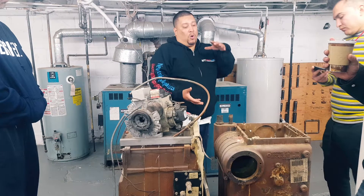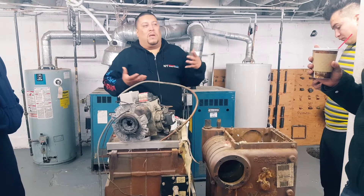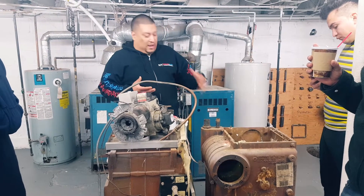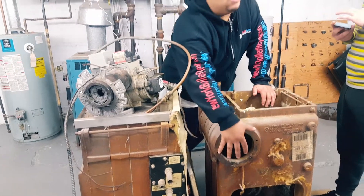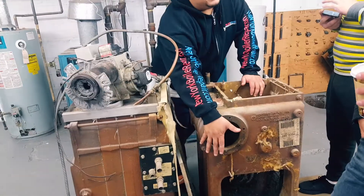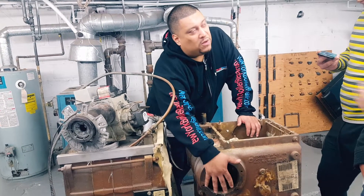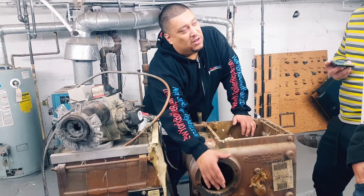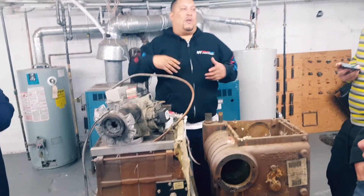You've got to put a coil to make a proper hot water system. The reason why guys don't do that is because it comes down to one thing: money. You're saying a coil is a heat exchanger. This heat exchanger can do anything — I can use it for domestic water or I can use it for heat. That's actually the proper way. But most people don't want to do it that way because of money, so they just put a loop, a pump, and a relay.